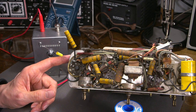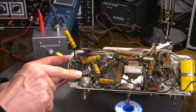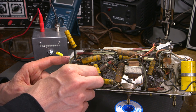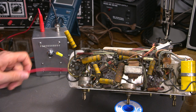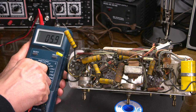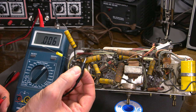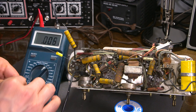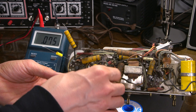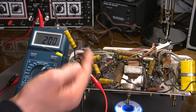Let's test this capacitor and see what it's going to do. Going to the 2 nanofarad range to give a little more range since it is over 200. Reading 200 picofarad - not bad. This one's actually gone the other way - it's a little bit low. So I'll grab a 220 picofarad capacitor out of my bin. This is a 220 picofarad capacitor - you can see that - 220 right there. The new one reads very close - almost spot on. There's probably a little bit of capacitance inside the meter itself, maybe a few picofarad in the terminal.